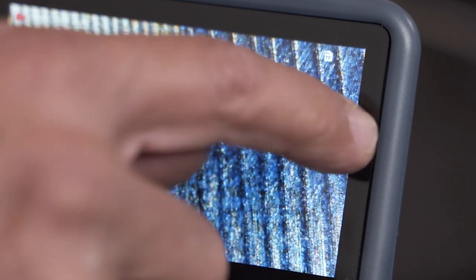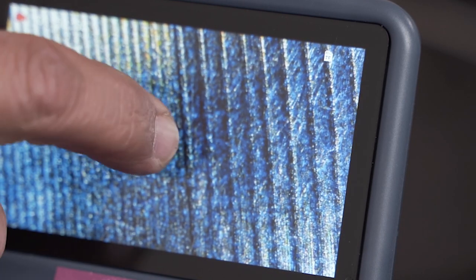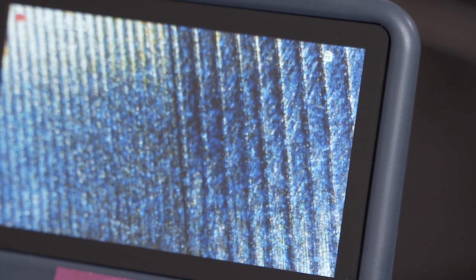And there you can see a clear transition between the surface, the flat section, and obviously where it transitions onto the radius. You will more than likely find that it is due to two things. One, the cutting tool, on the radius, is cutting on a different portion of the actual cutting tool's face. At the same time, if you're running a constant surface speed on a CNC, the speed will actually get faster and faster the closer you get to the zero point on your actual rotating axis.